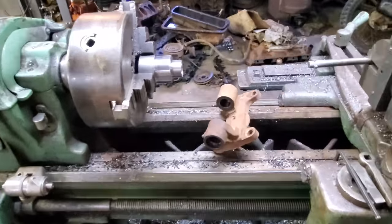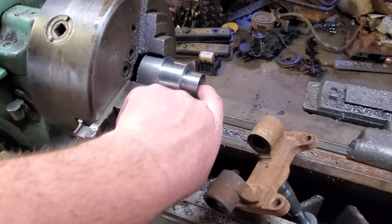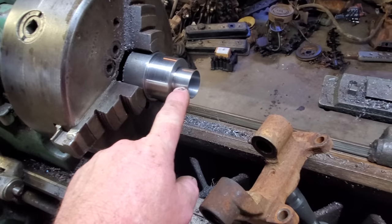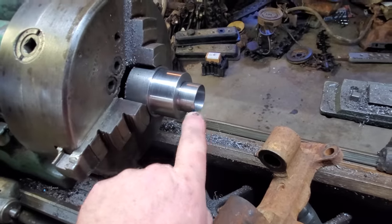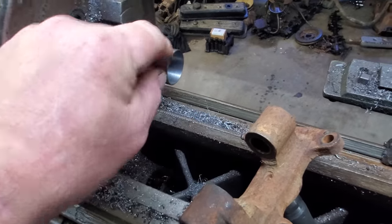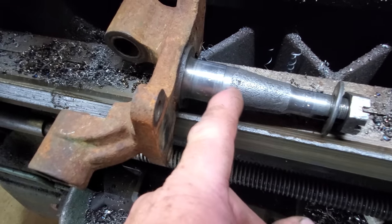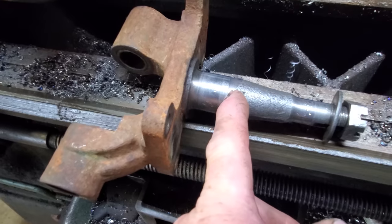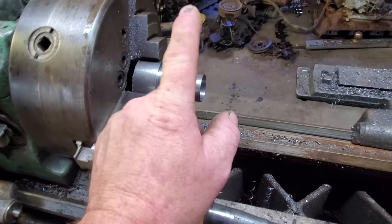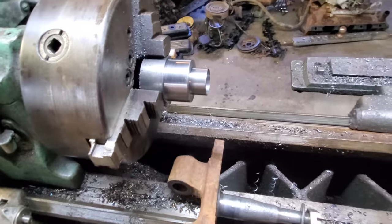It is the next day. I wasted half the day yesterday. As you can see, I've almost got the little bearing adapter done — I'm maybe 10 or 12 thousandths on the ID here. And that's when I realized this ain't going to work. Remember me telling you this area was going to be real thin? It's 30-thousandths thick right there. I was hoping to make it a press fit, but from here back is machined, it's got an itty-bitty shoulder that drops off, and this is only about an inch from here to here. That'll leave this area 30-thousandths sticking out, and as soon as I put a bearing on and put the weight on it, it'll either break this off or severely deform it. Yeah, I was pretty disgusted yesterday.